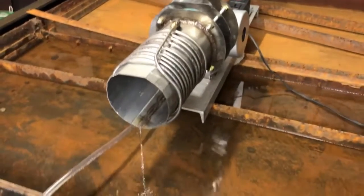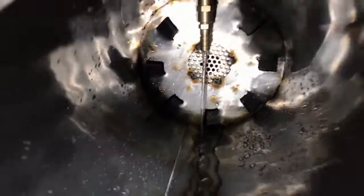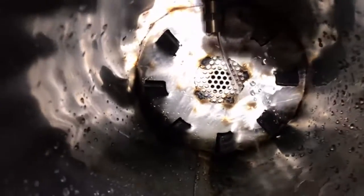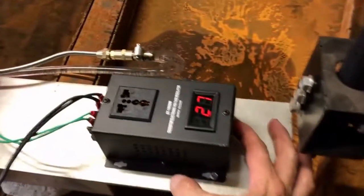I can see right away that I didn't like that at all — we're basically going to end up with a buildup point right there on that cold spot. Let's try dropping the fuel inlet down a little bit lower. I have a little dropper spout connected now, and I'm hoping to get that oil to fly out a little bit and get caught in the toroidal vortex. It might be a little too much — we might throw all the oil out the front. Going to 50% power.